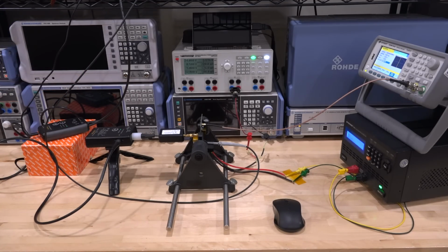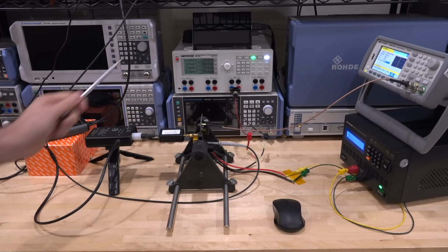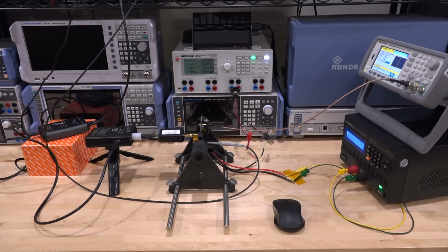So in the entire setup, you saw the connection between the probe to our board over there. Then we do have just a basic waveform generator over here to be used for the PWM input into the board, and then we do have our high voltage power supply, which goes up to 400 volts. That's going to be the main power supply that controls how much voltage is across the drain with respect to the ground of the gallium nitride devices. And we do have a 5 volt power supply over there. That's just all the logic and the conversion into the GaN drivers.